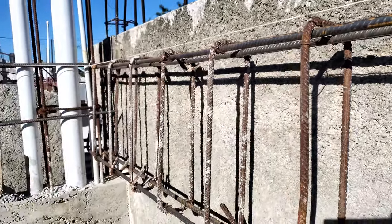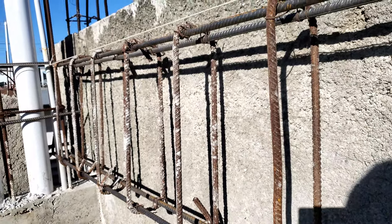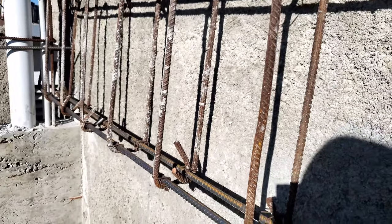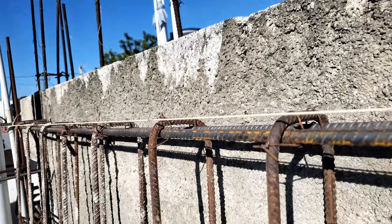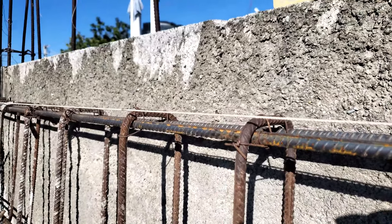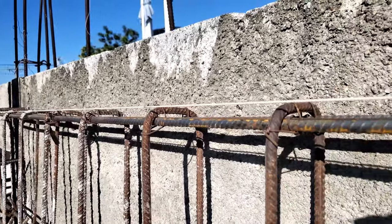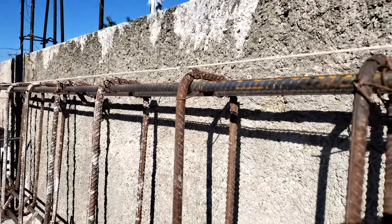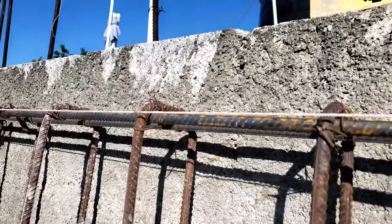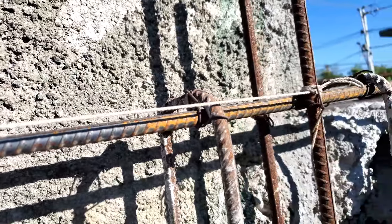Now usually you box up these areas, these beams, when you have no support, it's only support from end to end. You box them up and then you put the beam, the steelwork, inside. But right now it's all about preference, and I only have the steel right now. I mean, I have the boards for box up, so I just do what I can. So the middle now, when I board it up, I'm gonna just come up to the line. Put a stone underneath it and bring it up to the line.